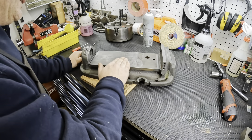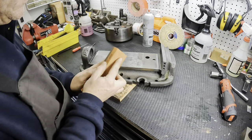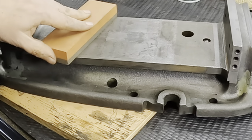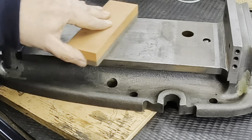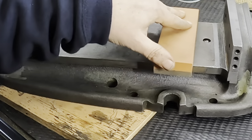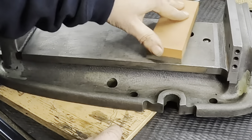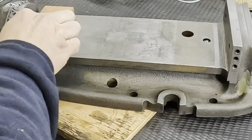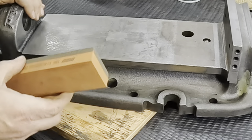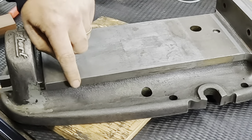I can hand clean this with some Scotch-Brite pads and some WD-40 - I'll probably do that. Let's take a quick look and hit it with some flat stones and see if there are any high spots that jump out. You can see it kind of catches right there, and then these stones just pull that high spot right off. Those shiny parts are the high spots. It does seem to be in pretty good shape. It's a little bit laid over on the side here.